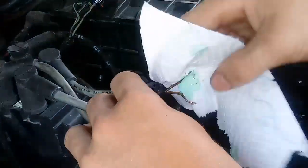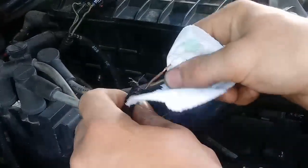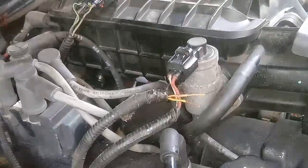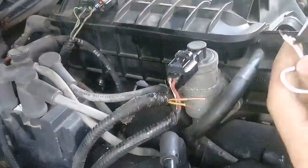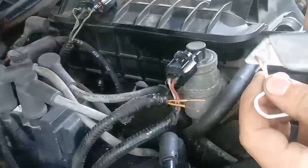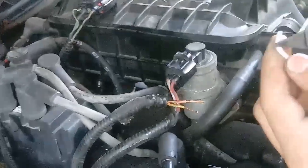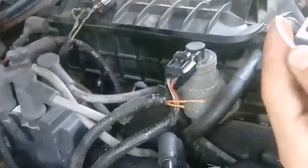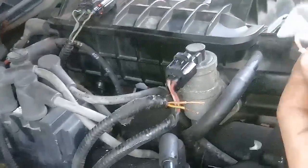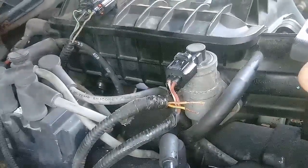You're basically going to clean the wires off — as you can see, they're kind of dirty. I just stripped these with a knife; you're supposed to use a wire stripper but mine is shot. You want to make sure that you watch the direction that the connector came off and compare that to the new white connector, because if it doesn't have a colored connector you'll need to know which wire goes where.